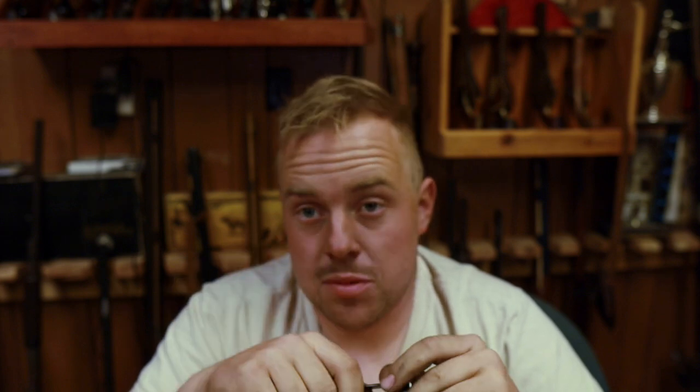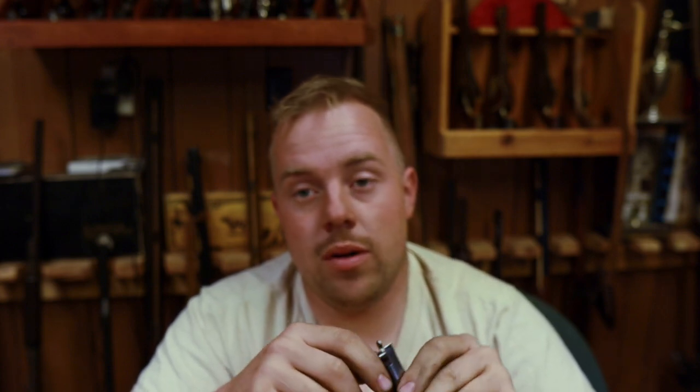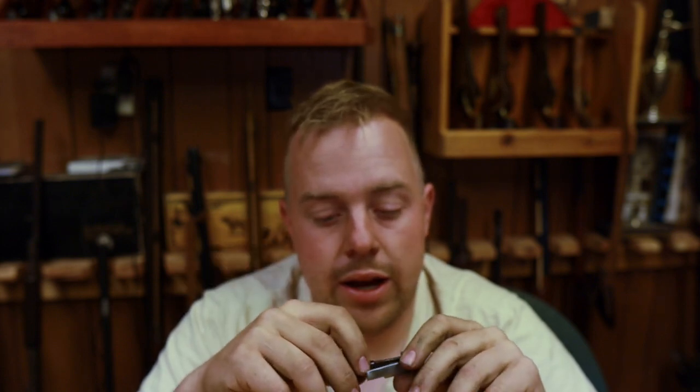Right now this thing is as hard as glass — as Mark Novak would say — and you really don't want to risk dropping it on anything too hard because it'll probably shatter. What we need to do is reduce that hardness. I've already been polishing it by hand for the last couple hours, and now I'm going to take it over to the lead pot and drop it in, let it sit until it turns a nice dark blue. Once it's turned blue, it should be the right temper for a spring on a gun.